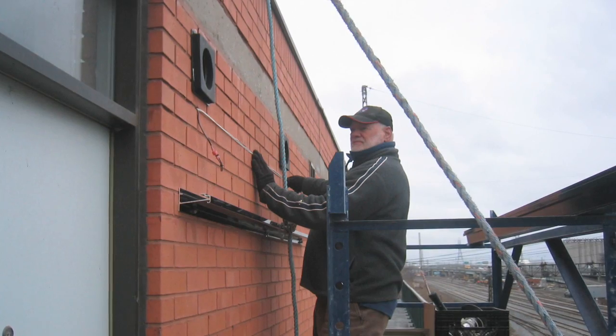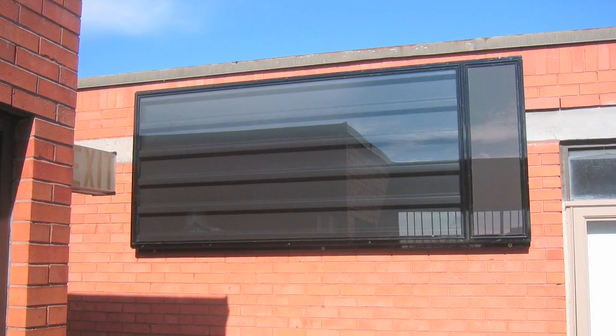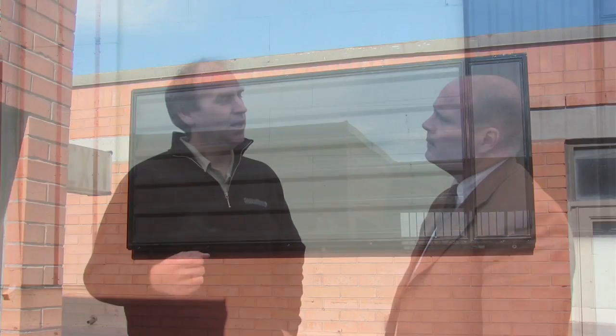But if it's just a solar sheet system, very quickly an installer can knock two five-inch holes in the wall, and the solar sheet can be installed on a wall within a few hours and you can be up and running. In that retrofit scenario with two holes in the wall, it's acting like a recirculation — taking the air out of the room, warming it, and bringing it back into the room. Is that the principle?